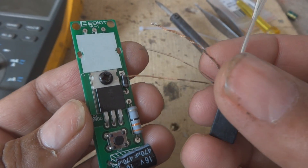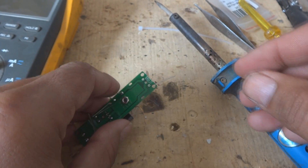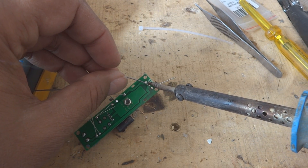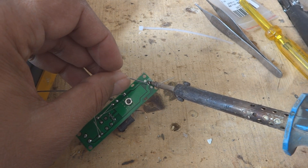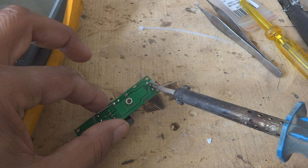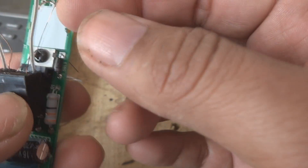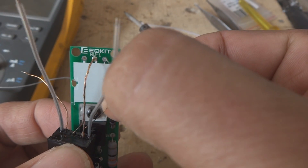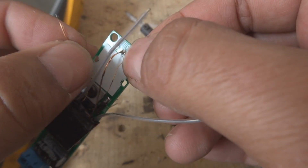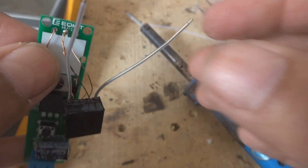For the transformer you should understand the connections — this is important. This double connection wire will go here in the middle. Then this small diameter wire, as you can see, will be here on the right hand side. This will go in this hole, and then this thicker wire which is for the collector will go in the first hole on the left hand side. So here we will solder all these wires.